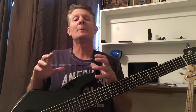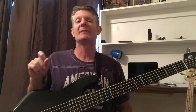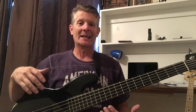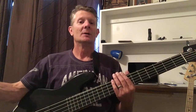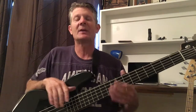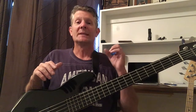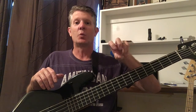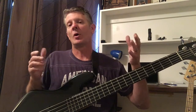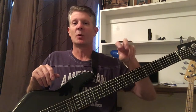Now, they've come a long ways. Since like 1987 they started making these SpeakOn cables, and your amp heads have these connections that allow you to lock your cable in to prevent it from being disconnected in the middle of anything, or somebody wandering around in the back and they snag your cable. They can disconnect that quarter-inch jack pretty easy. So the new amps, since 1987, come with a SpeakOn connection, and all it is, your cable has a lock. You stick it in there and you can twist lock it. It was created by Neutrik, but it's a twist lock. So you stick it in there and you can twist it and it won't come out.